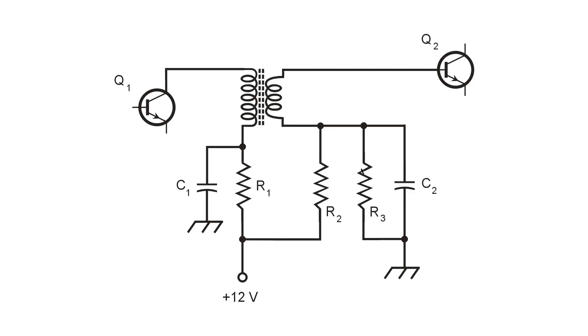This is a generic circuit — it does not specify component values, frequencies, or impedances. In the ideal case, Q1 will amplify the signal somewhat, perfectly matched, and Q2 will amplify it even more. You could conceivably cascade a third stage after this one, but more than likely this will be a power amplifier used to drive, for example, a speaker in an audio amplifier, or perhaps an impedance matching network leading to an antenna system in radio frequency applications.